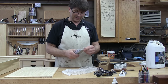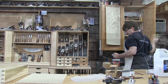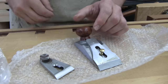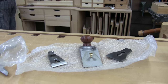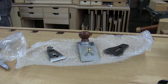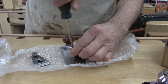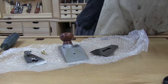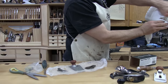Nice plane actually — it's a cast stainless steel body, so rust is the one thing you won't have to worry about. Now I'm just going to wipe the packing grease off. It gets really sticky, and I find it easier to get off with solvent than just trying to wipe it off. I'll get this cap screw out of the way. I'm just using paint thinner and a rag.